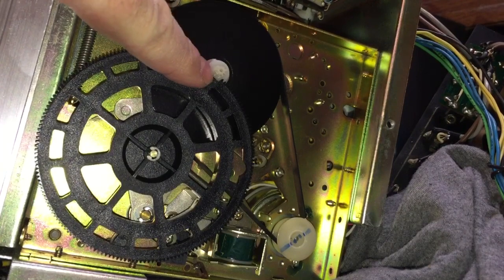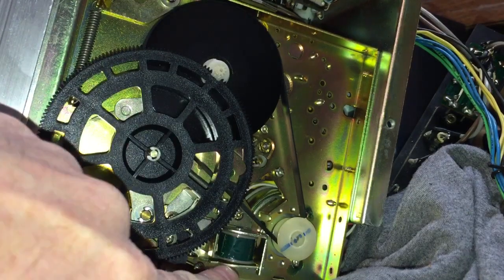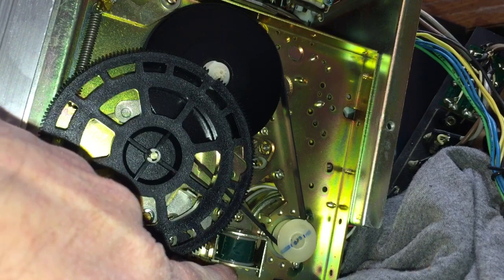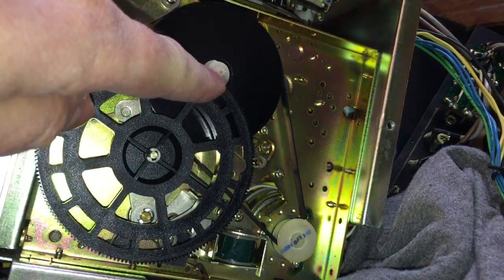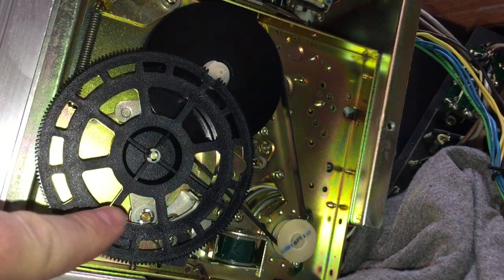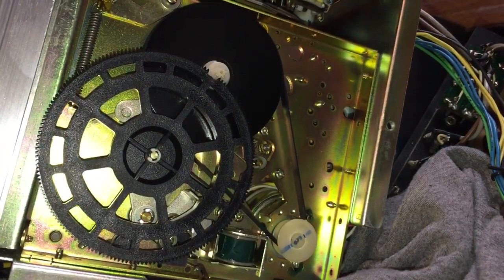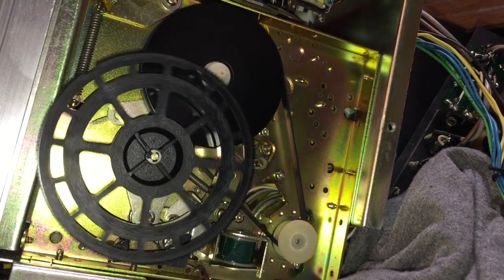And it has this little gear thingy on the bottom here, and then there's this big wheel. Well, this solenoid, when you press eject, the solenoid activates, which kicks this forward just a hair, and then this big Ferris wheel here, attached to this gear, begins to spin, which then drives that little rod forward that we saw earlier. So let me go ahead and stick my finger in the front here and activate the motor.